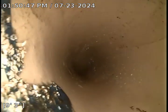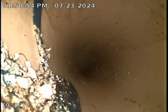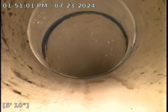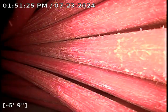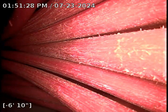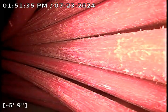You know, looking at this with the water shut off, looks like this is just ABS glue where some debris, little flakes of PVC and things have collected on there. It doesn't appear to be any issue in this section of the pipe. This concludes the video sewer line inspection at 6608 Southeast Clatsop Street. Serviceability of the sewer line does appear to be compromised due to area pooling and a potential party line connection. Would recommend sending the video off to the city for their review, as well as line repair.